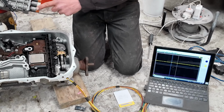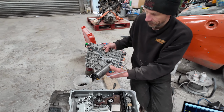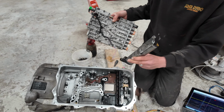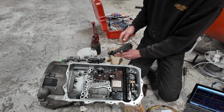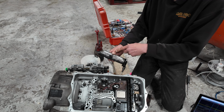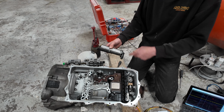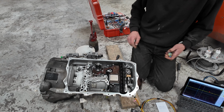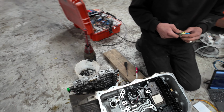So you've got them solenoids there, and that one, and then you've got a solenoid in there as well. That's a big one. Well, that's an accumulator. So it accumulates oil pressure in that, and then when you need, it's for stop-start really, so you don't technically need it. But if you needed an extra boost of oil pressure, you can energize that solenoid, and there's a big spring in there, it'll pump oil into the system. Faster gear changes. Faster than the engine can start up and move, sort of thing.